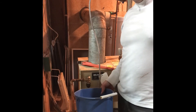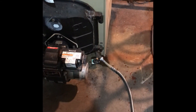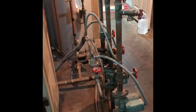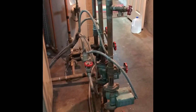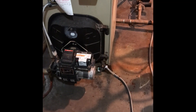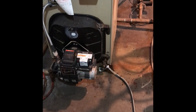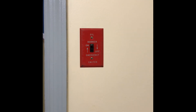As I get water back into my boiler, I'm going to put a bucket here just in case anything leaks. I've opened up my cold water feed and I'm going to let the furnace run water a little bit to get as much air out as possible. I'm not going to purge the zones, although some of you may feel that's necessary — if you want to know how to do that, you can watch some other YouTube videos. Once I let the water run through the boiler drain for about two or three minutes, I'm going to fire back up the boiler. I've flipped my burner back on and everything is back to normal.